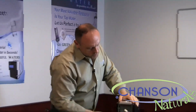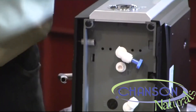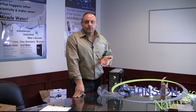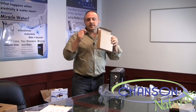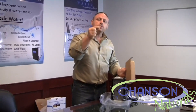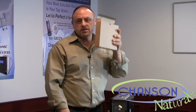You'll notice these two blue stoppers at the bottom of the machine. These are here to prevent any water leaks into the machine. Go ahead and remove both of these by pressing on the collar and pulling them out. Please never throw these out or lose them — store them in your accessory compartment because if you ever ship the machine back to us for service or warranty, these will absolutely need to be in place. Any spare part you have should be kept in the accessory box permanently.